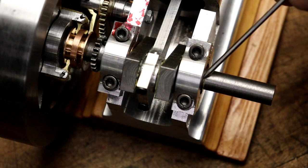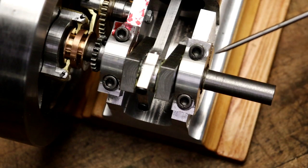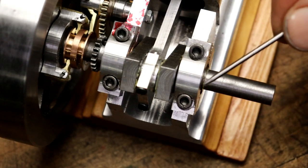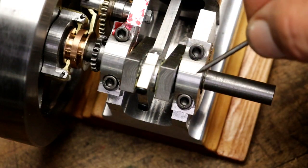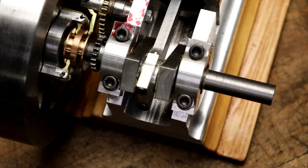I'll make the bushings - just the one over here, not going to remake the other bushing. I wouldn't have line bored the bushing - I would have line bored where the bushing fits in. Because that's a bad habit: if you get in the habit of having two bushings in something, have them clamped down and then line bore the bushings, you're asking for trouble - if the bushing turns then you're out of alignment. You want to line bore where the bushings are going to sit, not line bore the bushings.